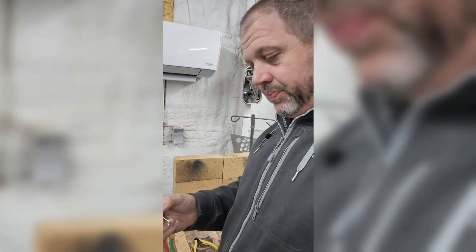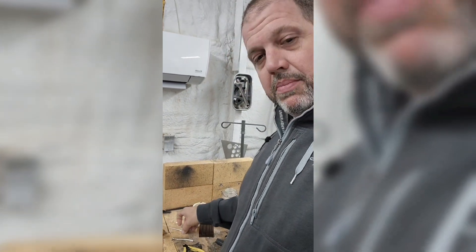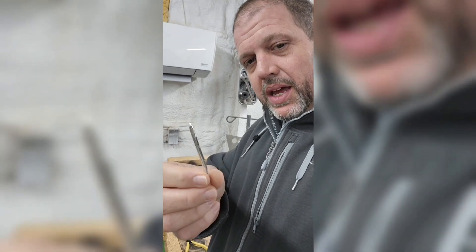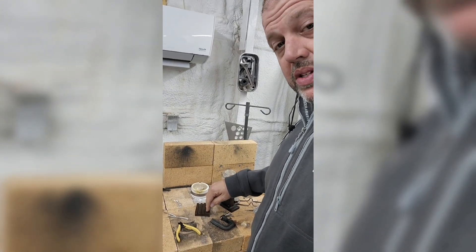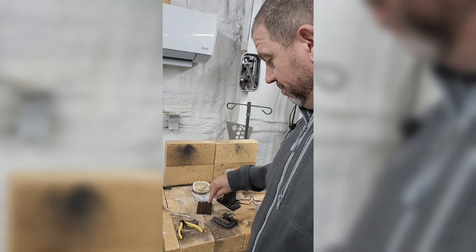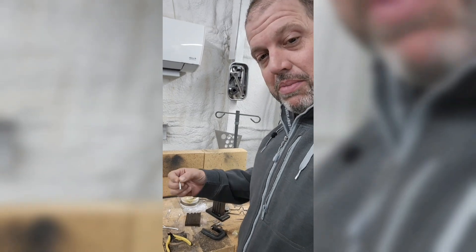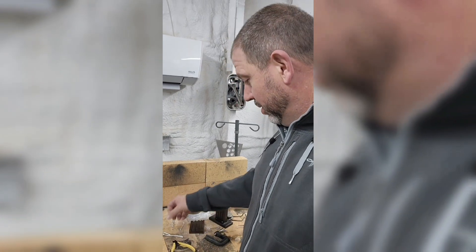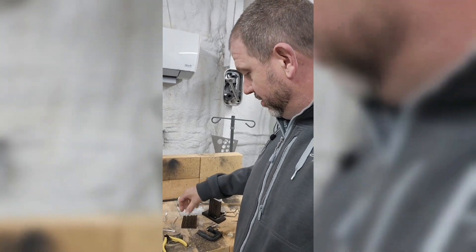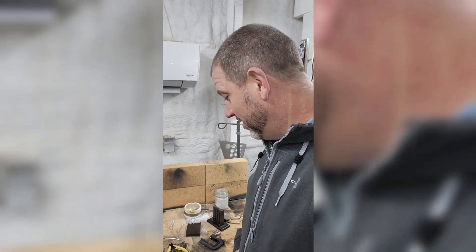I found it quite difficult to pour because of the temperature of the mold. I didn't have my secondary torch set up to heat the mold, and when I was trying to pour into some of the smaller grooves it was literally cooling and plugging up. So I was only able to get these little stubby bars out of the smaller channels, but I can work with the thicker bars from the bigger ones where the mold didn't cool the metal too fast.